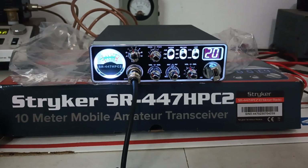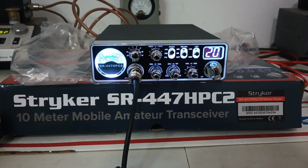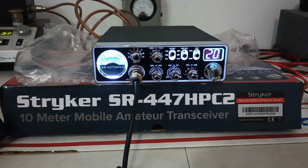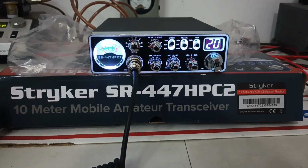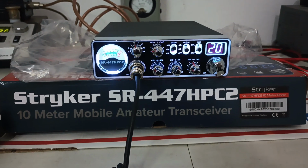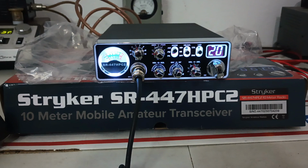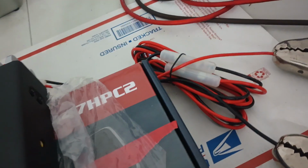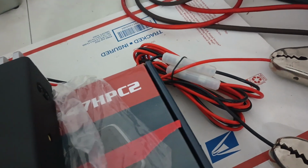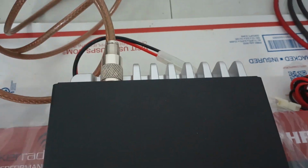First one I believe I've offered this way, but we'll let the video speak for itself as far as the performance goes. We will be testing at 14.6 volts. Now, one thing I will say, guys, you can get this radio to do even better. If you want just a little bit more power out of it, one thing you can do that I will leave to the customer is, for one, shortening up this big wad of power cord that these things come with. Also, increasing the size wire.